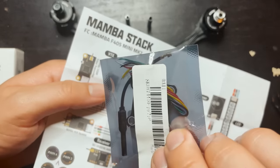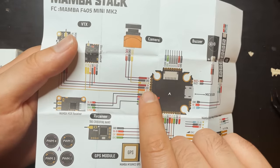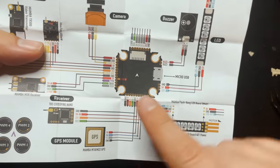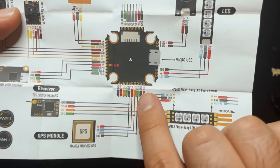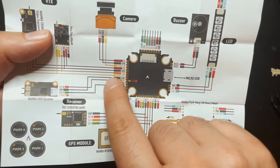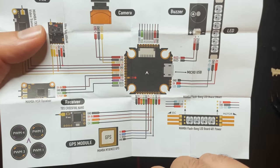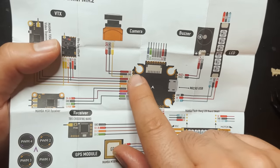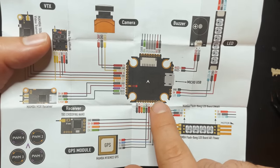And for this specific video transmitter, this requires 7 to 27 volts. So I'm not gonna get enough power if I use this 5-volt pad that they have going to their video transmitter. So I'm gonna have to find a pad that says VCC or battery power. And that's right down in this corner. So I'm gonna have to power the VTX off of these two pads and have the video out wire run straight to the VTX. So I'll use this power and ground, and then the TX3 and video out over there. And then the receiver we can figure out afterwards, but I'm just gonna put some solder on those three pads up there, these two right here, and then these two right here.